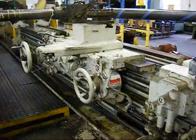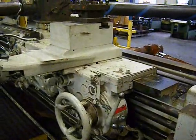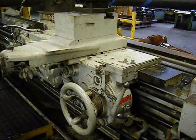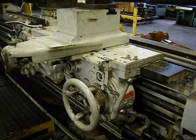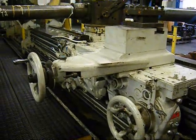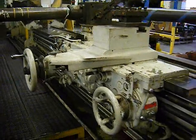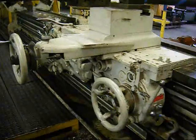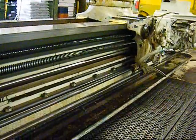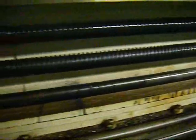The machine is equipped with a cross slide with threading. The cross slide has been removed and put on behind the turret for the particular job they were running on this machine, and can certainly be reversed. This sliding gap bed lathe is equipped with threading and rapid traverse.